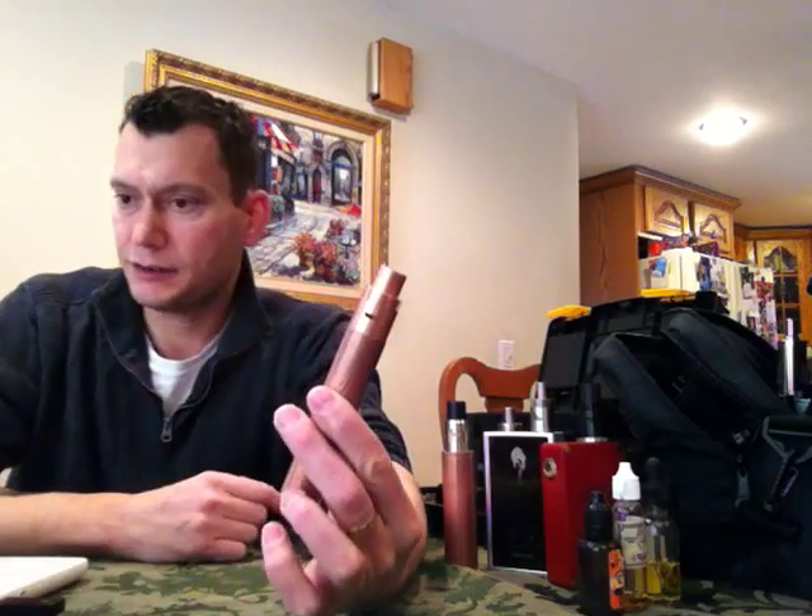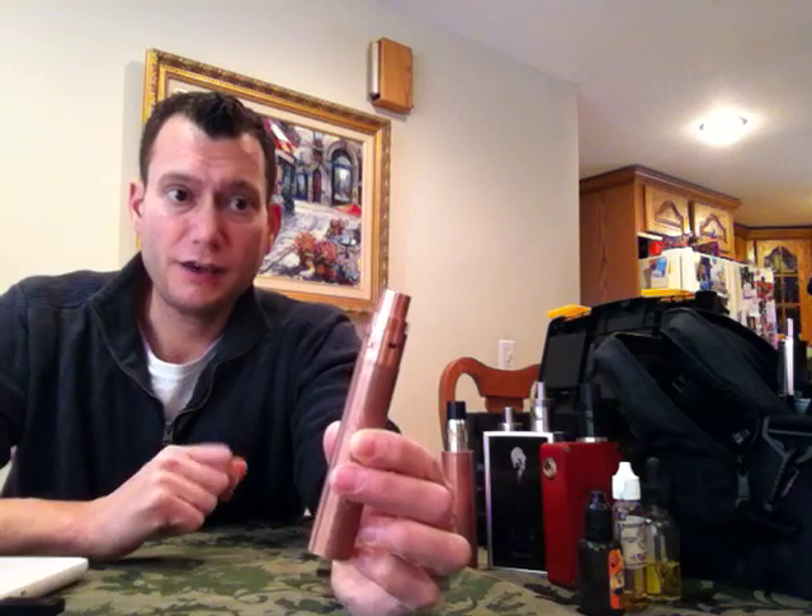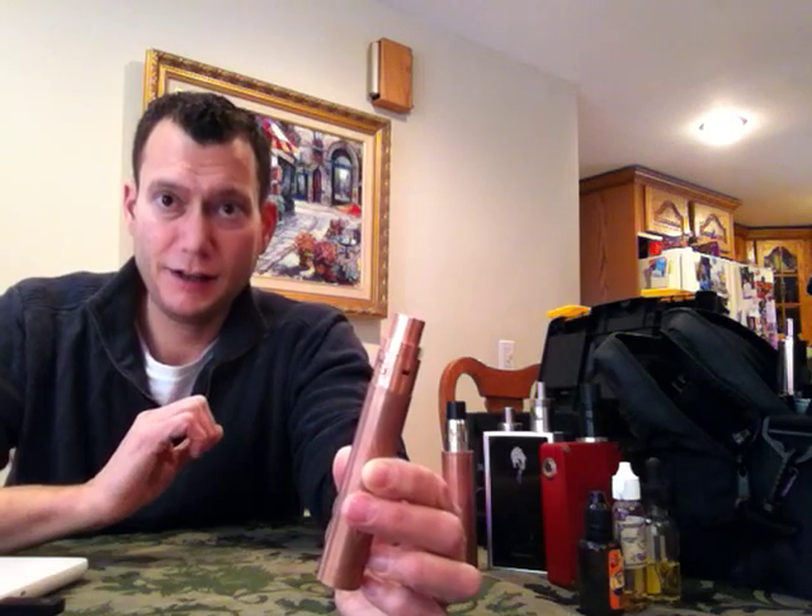I have Steam Engine up on my laptop — it's also an app for Android, not for Mac or iPhone. I'm running unregulated, which this mech mod is. Atomizer resistance: I'm at a .18 ohm build because I checked it on an ohmmeter, so now I know my resistance. But I want you to understand something: as metal heats up in a wire, the resistance goes down. So if you start out cold and read this, if you take a 1-second hit, do you realize at the end of that hit your ohms are lower?